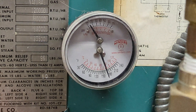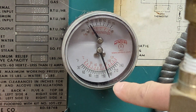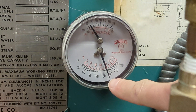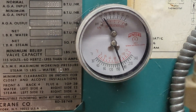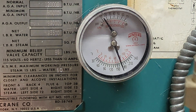While you're running this in manual mode, you're going to want to watch it very carefully until you get a hang of how it runs. You really don't want this to go above 180 degrees — at least on mine it typically runs at 180 degrees. When the heat is off it goes down to about 100–120 degrees. So during a power outage you may be down here quite a bit making sure the temperature stays stable — turning the switch or manually closing the relay on and off — focusing on just keeping your house warm, not running your boiler really hot.